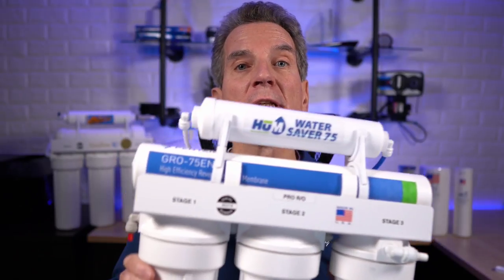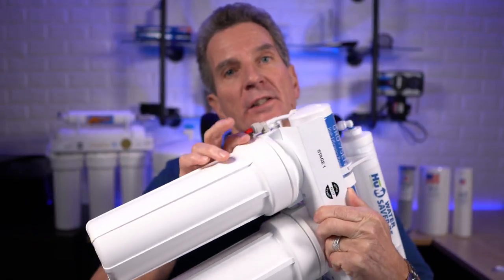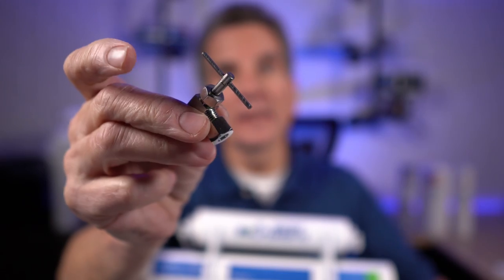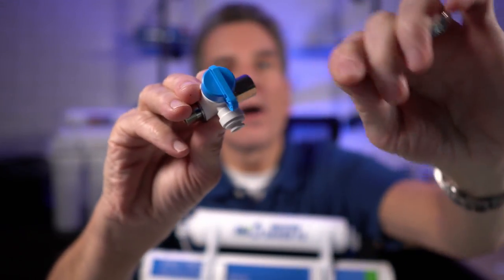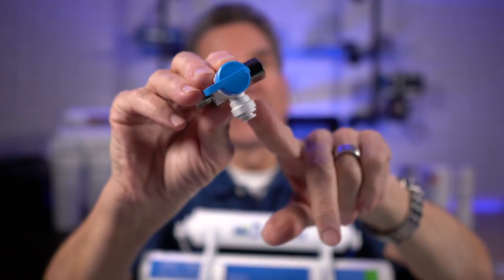The first thing you need to do is shut off the water going to the reverse osmosis system. If you're not sure where your shutoff is, look for filter housing number one — beside it you'll see the tubing connected to it. Follow that tubing back to where it connects to the plumbing; that's where your shutoff will be. Your shutoff might have a T-handle on top — turn it clockwise to close that valve. Or you may have a lever-style shutoff: turn it 90 degrees, and when the handle is 90 degrees toward the direction of where the tubing is coming out to the reverse osmosis system, that shuts the water off.